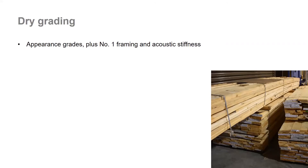For the grading, we graded to a range of appearance grades. We didn't have a clears grade — every single board had knots in it — so we had what we called a cladding grade. This is similar to the dressing grade in the New Zealand grading standards but has tighter specifications around knots. This is intended as timber you would use for a cypress weatherboard, which is quite a common high-value application for cypress sawn timber in New Zealand. Then we had merchantable grade and box grade, which is essentially reject, and then number one framing, which is a visual structural grade.